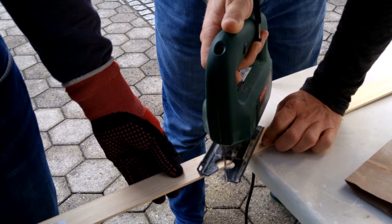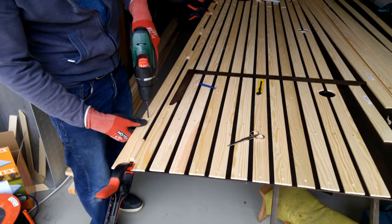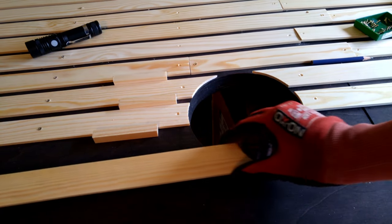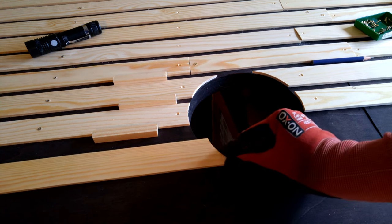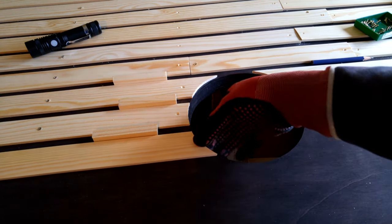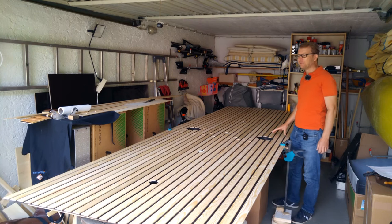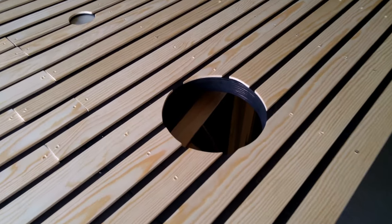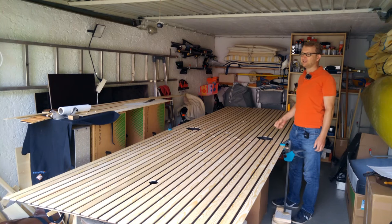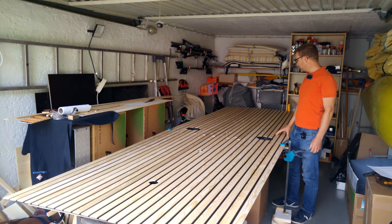You could now continue with painting the slats, but I prefer first cutting all slats to the correct length and pre-drilling the position of all screws. Each slat is four centimeters wide and we use 12 mm spacers between the slats. It's already good to imagine the final look of the ceiling — but before installing we still have to paint, and before painting it's important to number the slats, otherwise assembly could become a nightmare later.